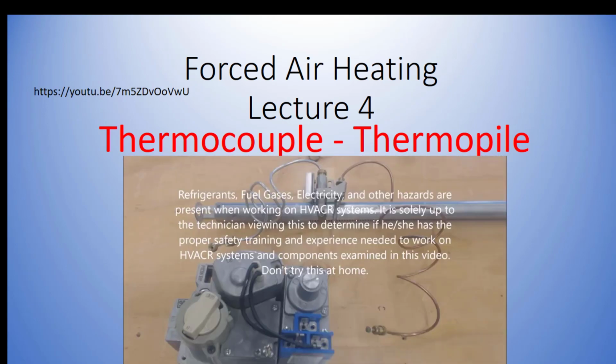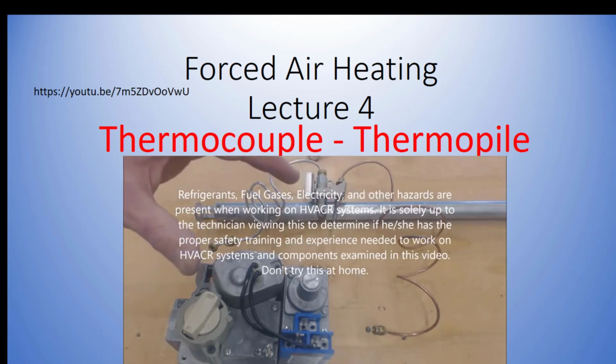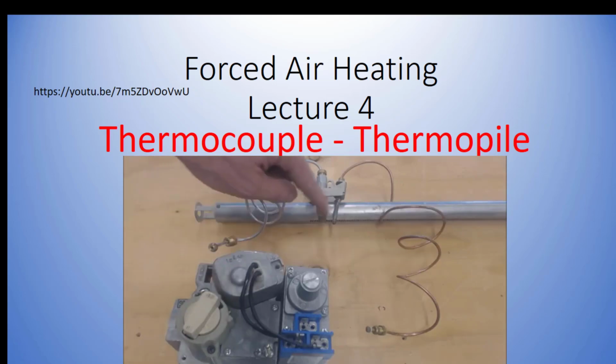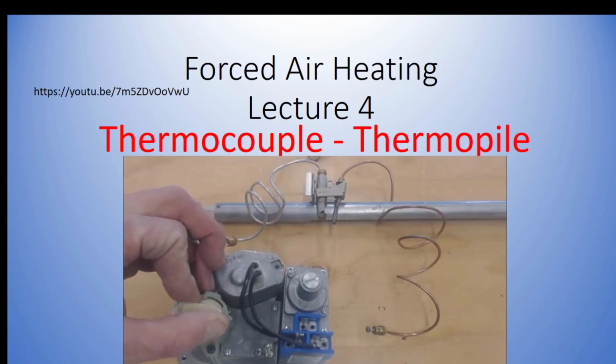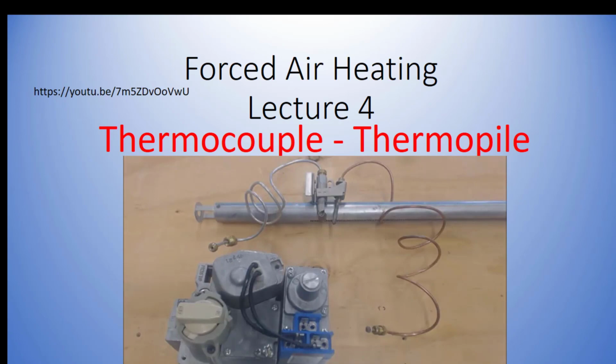Hey guys, this is AC Service Tech, and today what we're looking at is the combination gas valve and thermocouple, and how the two work together in order to hold the pilot on. After you have a pilot lit, you can then turn this gas valve to on, and then you can power between here and here with 24 volts, and then you can get the main burner to light.